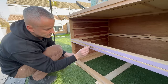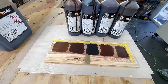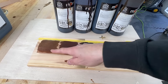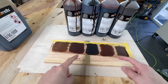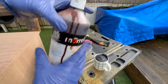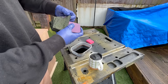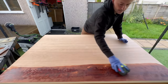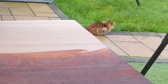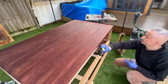I got an okay from the inspector and applied the gilding wax — that line was basically asking for something like that and I thought it looked cool. I'm just testing some stains: Jacobean dark mahogany, black, plum mahogany, and walnut. Definitely not black, but I think I could be happy with the rest of them. I went with plum mahogany, and I know at least one of you is going to hate it, but I'm keeping this for myself and I really like this color. Because the surface was so huge I wasn't perfect with the stain so it was a bit blotchy, but I did another coat diluted with alcohol to even it out and it came out just fine.